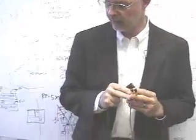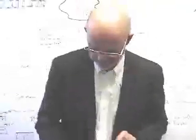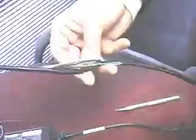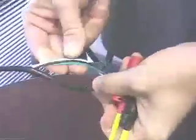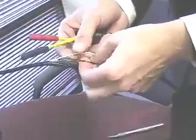Once again, we've got a computer — it's plugged into a wall outlet. For a variety of reasons, we've decided that the easiest way to seize this computer is to attach directly to its power leads. So we're just going to do it. We're attaching our adapter directly to hot plug. We've already plugged hot plug into a UPS. We've gone to the trouble to take the power cable and slit the sheath. The sheath has been opened up and the three power leads removed. You can do that with an exacto knife or preferentially with a sheath splitting tool. Now we're taking a look and we're going to identify our hot, neutral, and ground.